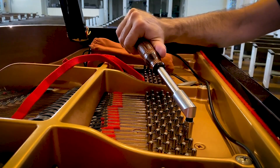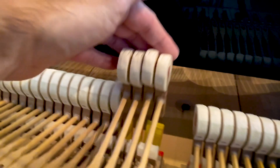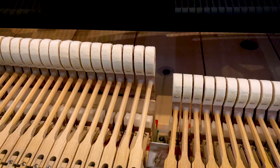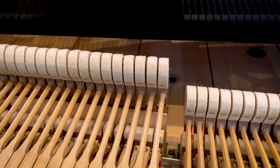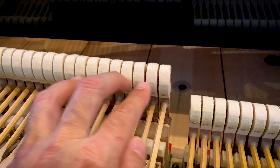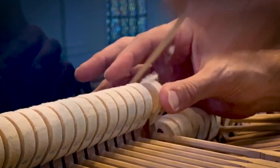For these hammers you can see even in the top ones they're angled just a bit, getting to a pretty severe angle over here. Of course the bass is all angled, so we're going to take these one by one with our little single-hammer strip. Same process: from the thickest down to the second-to-thinnest, then back to the thickest to clean up the top, then polish probably with the wide paper and gang filing for the polish of the top — because mostly it's parallel up here but not parallel across the sides. I get to an angle about right here with my eyes so I can see the front and the back as I do one by one, making sure I've got a good shape. Let's go to the time-lapse.